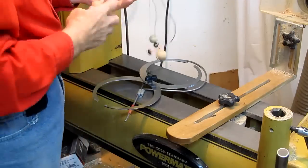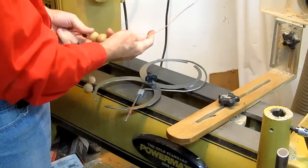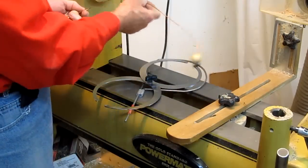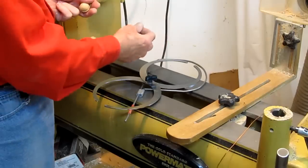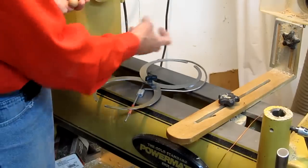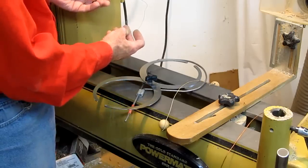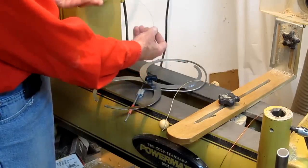Here's some burn wires in different size diameters. This is probably 10 or 12 gauge copper wire — it works real well for doing a nice burn line. I just loop it around and put knobs on it so I can hold it. They don't last forever because they get hot, become hard and brittle, and eventually break, but they're cheap and easy to replace. This one is made out of guitar wire I got from my son when it passed its useful life. And I've got some nichrome wire — if you ever get an old toaster, you can take nichrome wire out and use it for making very small, detailed burn lines. So I've got three different sizes.